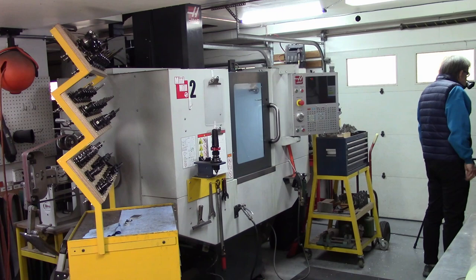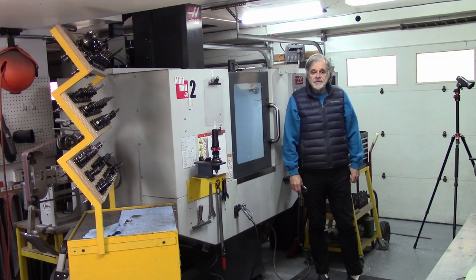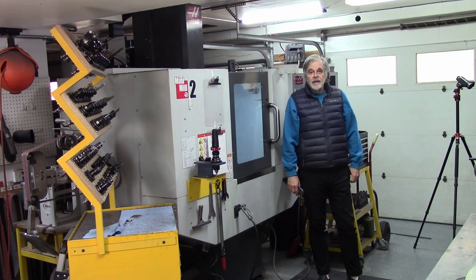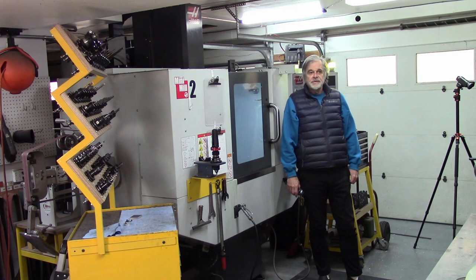When I make these glass pieces, I start out with a 250 thousandths saw cut blank, and then they're pressed together, fused together on the ceramic plate, and squeezed and mushed around. I try to make them as flat as I can, but this results in a surface that is not perfectly flat, somewhat uneven, and a little bit degraded by the process of chip stack assembly. So when I take them out to the cold working shop, I have plenty of material to grind away for a final target size of 150 thousandths. When I measure the piece that I made, it's anywhere from 155 to 160. For glass work, within 10 is fine for me.